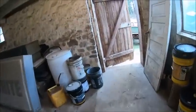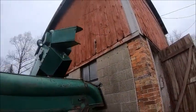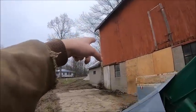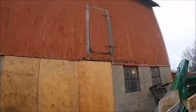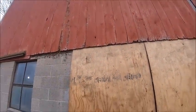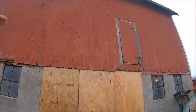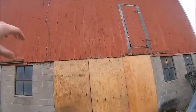The main project today is I want to get this trim pulled off the rest of the way, at least down to where that door track starts. And I want to get measured up and get the siding sawed off. And for now, I'll probably just run a screw. I could probably get away with just every other board, because that stuff's shiplap, I think. Yeah, that's shiplap, so I don't need to necessarily do every board. Basically, I just need to run some screws in it to hold it for now, so that it can't go anywhere. And I'm going to have to brush or wire brush it and get the shit cleaned off of it once we get it cut up where it's going to be.